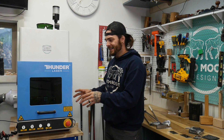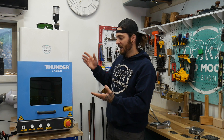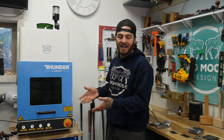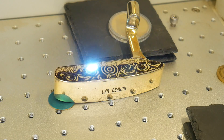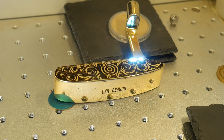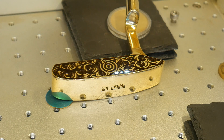When I bought this machine, I didn't really understand all that - I just knew I wanted to do some deep etching, so I got the biggest one I could get, which was a 50 watt machine. For me it's fine - I'm just doing a bunch of brass coins, and the 50 to 100 frequency range is just fine. Back to the brass putter - I'm doing a low speed, high power darkening pass, and it really puts a nice black finish on the putter. Then just a couple of cleanup passes to make the design really pop.